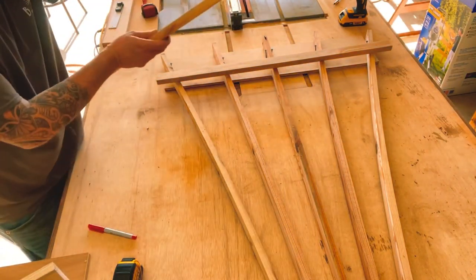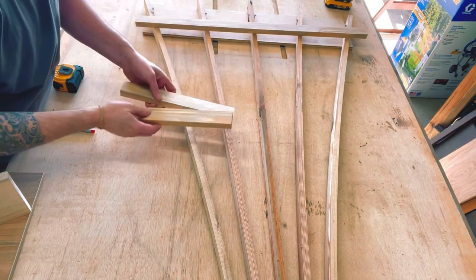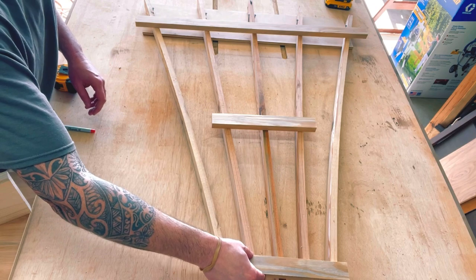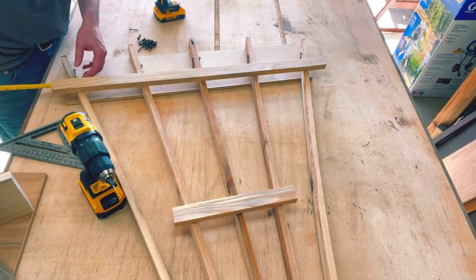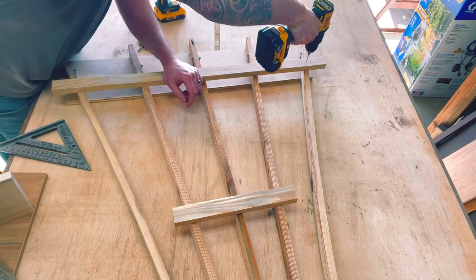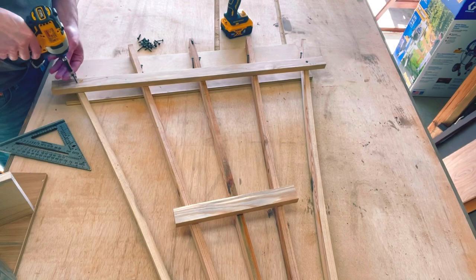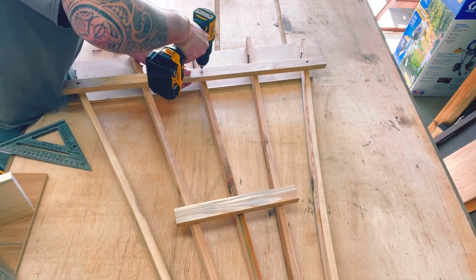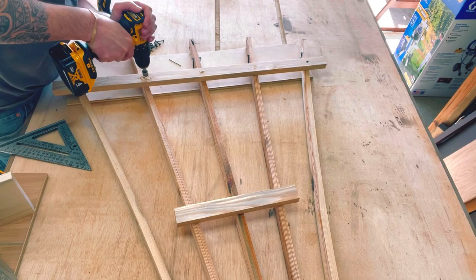The spacing is completely up to you. Once you know your spacing, you're going to figure out what length board looks best at that spacing. I decided that 12 inches will cover three of our straight boards, and 12 inches dropped down will cover all five. So at this point I have a 42-inch board and two 12-inch boards. I'm squaring up my top board and making sure we're even on both sides, squaring from the center board. Now I'm putting the two outside screws in — I'm using exterior deck screws. Since my material is 5/8 thick, I'm going to be using inch-and-a-quarter deck screws.